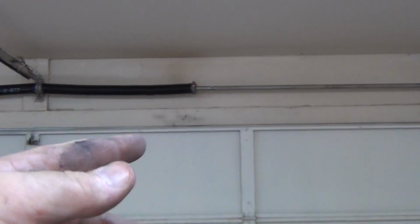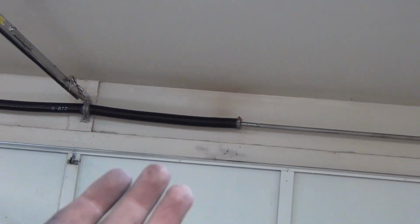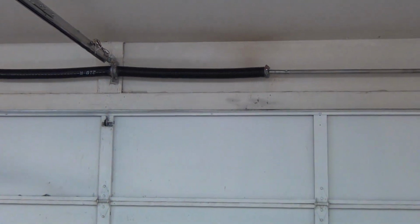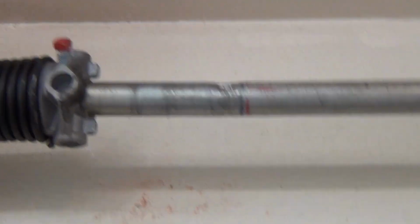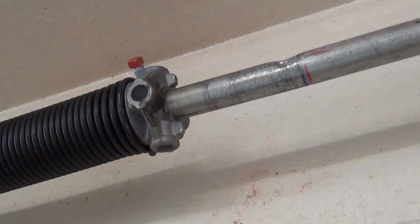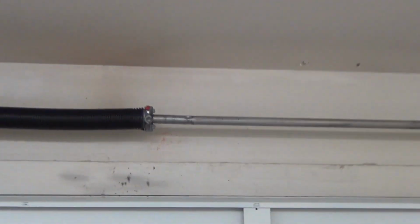You're going to rotate it in the direction so that it's loaded to pull up, to rotate back up toward the ceiling and back down. So the loading will be on your shoulders essentially. You'll see that coming up. How do you load it? Well, this is how I load it. You call a professional. There's a couple of holes on either end of this spring in these keepers. There's one at the top, one at the bottom, and it goes all the way around like that. There's 4 of them. And as you rotate it, you have to transfer a rod into that to keep it from spinning. So you have 2 rods.